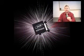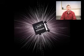I'm Jon Cronk, Applications Director for the Power Management Group, and today I would like to present you our latest flash LED driver designed for use with low-profile supercapacitor technology. With a drive of up to 4.3 amps, resulting in over 400 lux, this device, the XRP6840, is today's most powerful flash LED driver on the market.